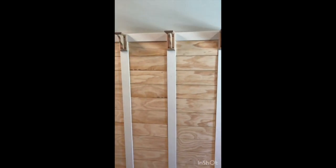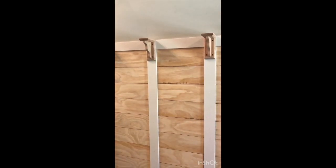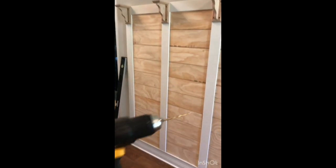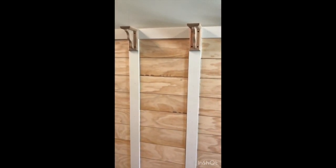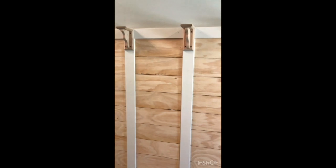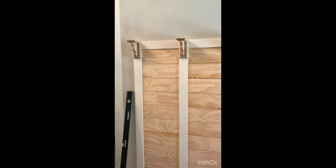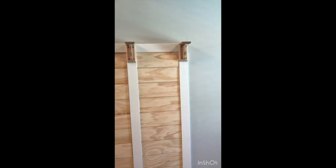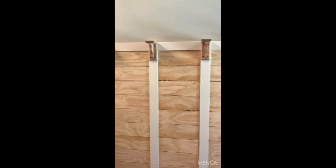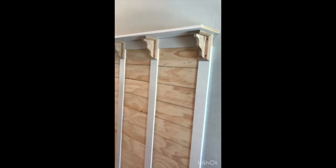All the corbels are up. I'm putting in two small nails with the nail gun to hold each one — one nail wasn't quite enough. These corbels aren't the best quality but they'll work for our purpose. Make sure you pre-drill every single hole before putting your screws in. I'm not anchoring into wall studs here because the corbels are going into wood — there will be about 16 nails in total — and the shelf going up isn't heavy and won't have heavy items on it.